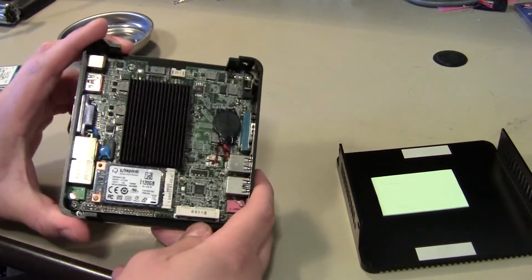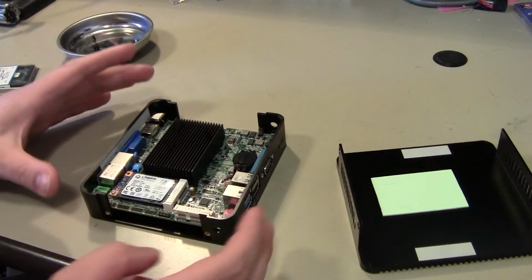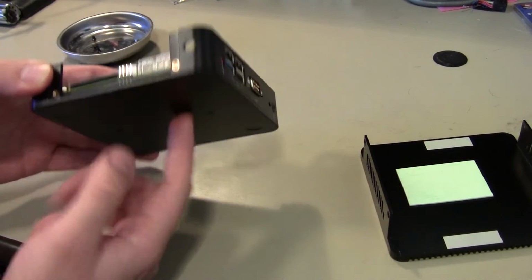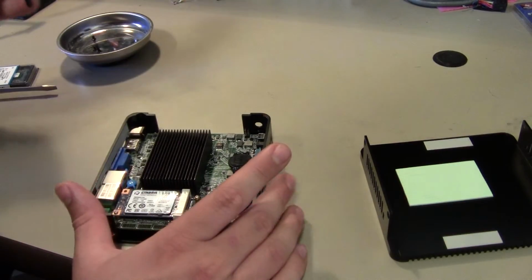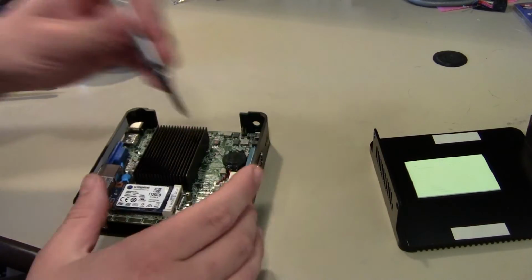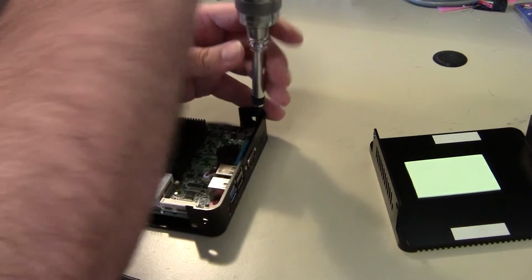That being said, you'll notice that there's no RAM port on here because it's actually underneath there. So we have to get the case pretty much all the way apart. This case is actually 4 pieces. We've got the top anodized part, 2 more anodized parts that are the faceplate, and then an actual, I believe it's plastic base. So we're gonna have to take all the screws out. Yeah, I think you do have to take all the screws out because the 4 screws holding the motherboard in, it's also wedged in here. So maybe we only need to take one of the 2 face plates off. But in any case, the motherboard is definitely coming out.